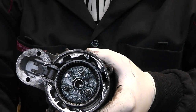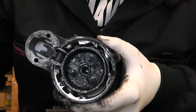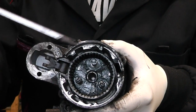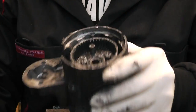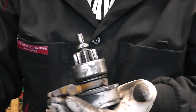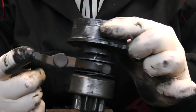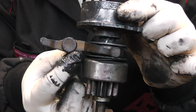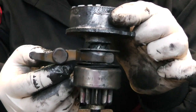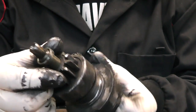With our gears removed, inside where the motion is there's a little ball bearing. Be careful when you're taking it apart not to lose this little ball because it's very important - it actually holds up the armature. Now with all this done, turn it upside down and pull the drive end out. Here we have the forks and the pinion. Have a good look at how the fork actually fits the pinion - it fits this way, not the other way. So when you're reassembling everything make sure the fork fits at this angle.